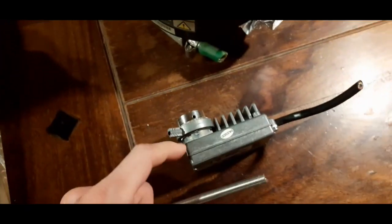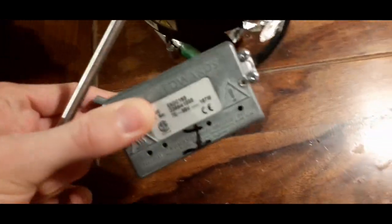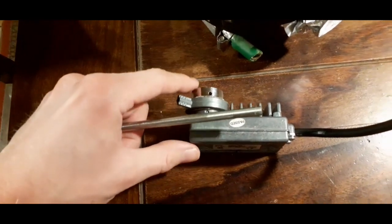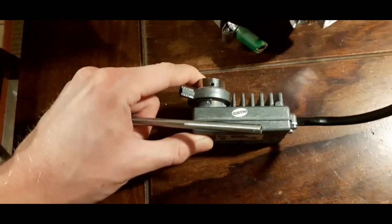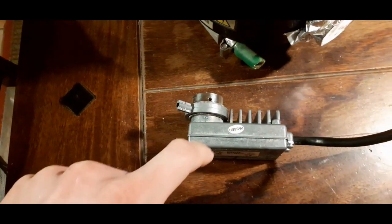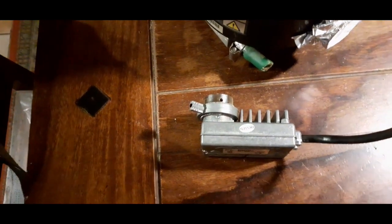And the pump came with this nice little directly mountable controller, which is a 160 watt controller that contains all the VFD stuff and all the driver transistors and, well, basically it does all the things and also has some brain power and can actually monitor the status of the pump and shut it down if it gets too hot and stuff like that.